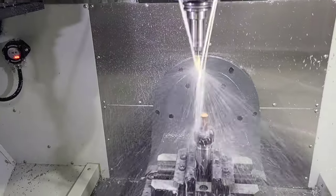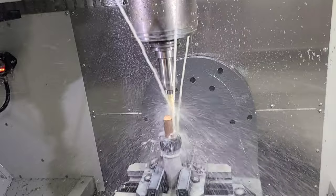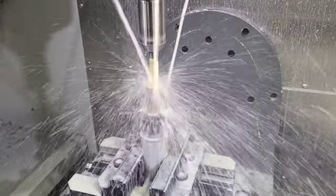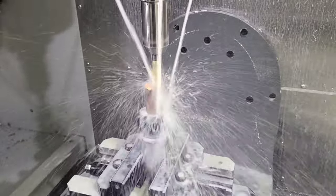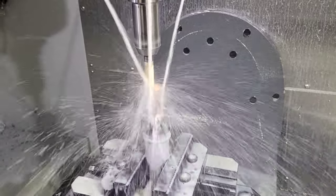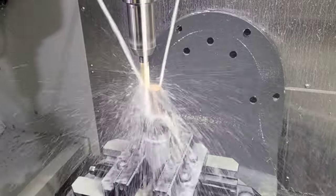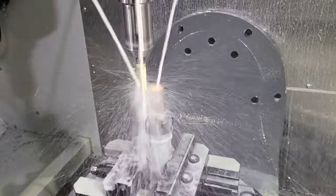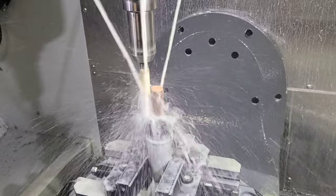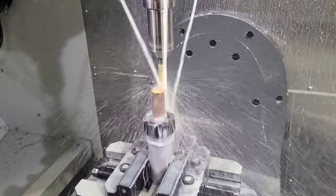Here we go. It's going to bring over a half-inch carbide end mill and it's going to start facing off the top here. We're going to skip ahead — there it is doing the second to last pass, facing it off. After it faces the stock down and finishes the top, we're going to go into a path to start going around the outside of the part and start creating the shape of the disco slug.